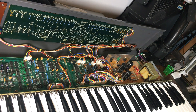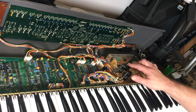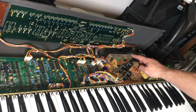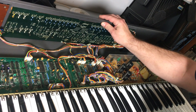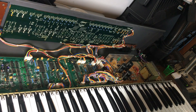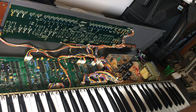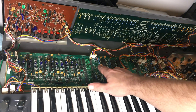And there we are. It's pretty straightforward, nice linear power supply. Big aluminium heatsink for the voltage regulators. Up the top here we have the front panel PCB with all the knobs in. And this board on the left is all the analogue IO MIDI microprocessor board. I previously installed a battery holder when the battery needed changing. And here is the analogue voice board, which is what we are going to have to take out.